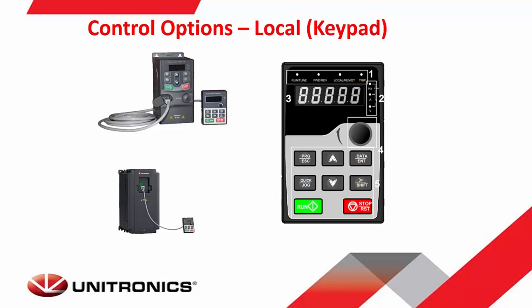Number two shows you the units and what is currently being displayed on the 7-segment display, which is marked at number three. Number four is your potentiometer dial, and number five, your push buttons. Using your potentiometer dial and your push buttons, you can have full control over your VFD. You can start, stop, jog it, and then as well program separate parameters using the program key, allowing you to enter in motor parameters, acceleration, deceleration, and many more.